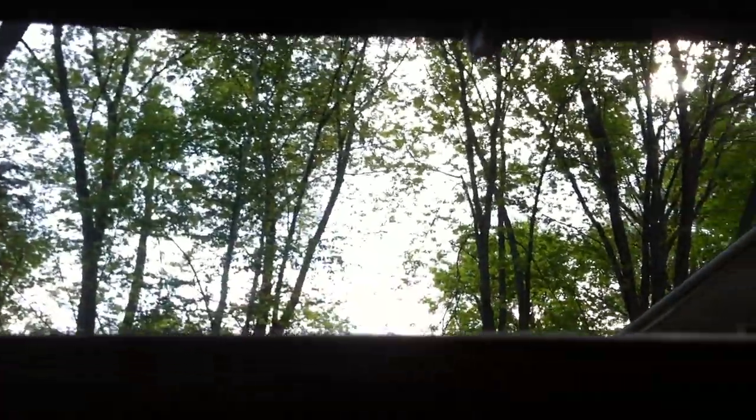Then lower it slowly the tiniest little bit so it's just at that point where it's touching. You're going to grab both sides of the top and pull down — not all the way forward, just a tiny bit more. There's about a finger-width gap just before it latches. You'll hear a clicking — that's the point you want, like a door catch grabbing the striker. Pull it up and down on both sides quickly like this to center that latch pin. Once it's centered, gently lift it, raise the top open, and tighten it back down without moving the plate. That should 99% of the time do it.